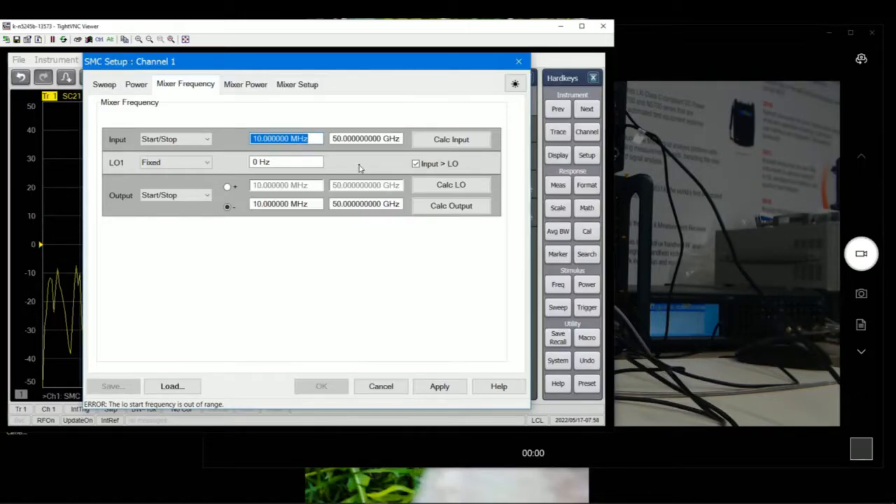So we're going to try starting from 3 GHz with a few points up to 3.5 GHz. The LO will be fixed so that we can vary the IF. From there we calculate — we can choose top or bottom, up-convert or down-convert. It varies from 500 MHz to 1 GHz, and the IF spec for this mixer is between DC to 1.3 GHz, so let's put it within the 500 MHz range. If you want to fix IF instead — say at 60 MHz — you can calculate the LO that's needed, which will vary and always generate a fixed IF output.